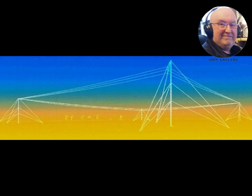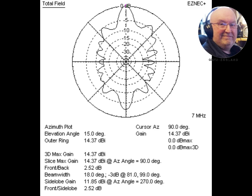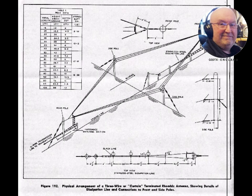Each of the four sides is the same length. The length is not critical, typically from one to two wavelengths (lambda) end to end, but for any given length and frequency there is an optimum acute angle at which the sections should meet. A horizontal rhombic antenna radiates horizontally polarized radio waves at a low elevation angle off the acute end opposite the feed line.